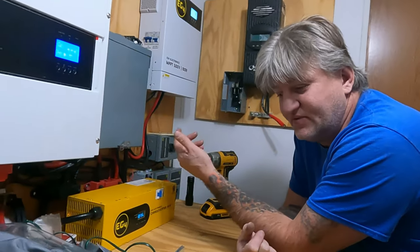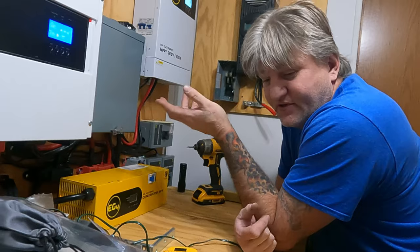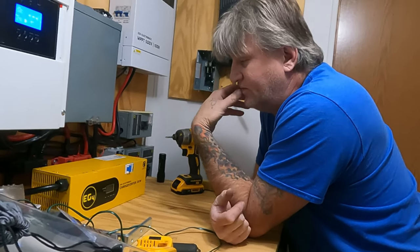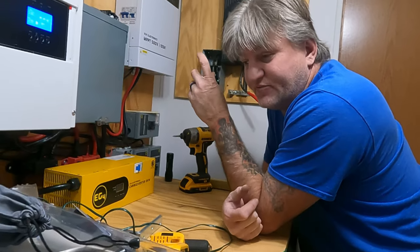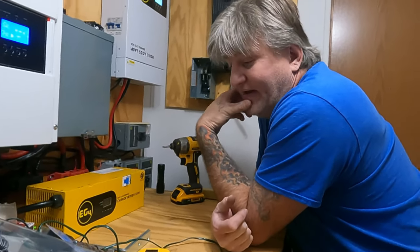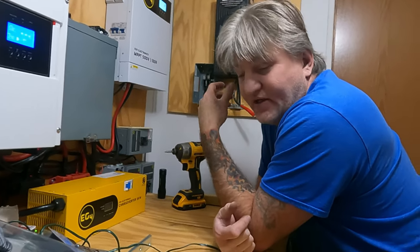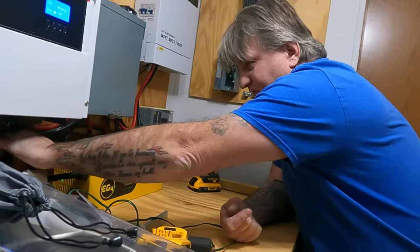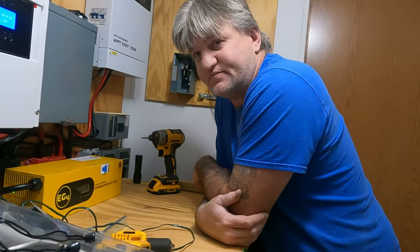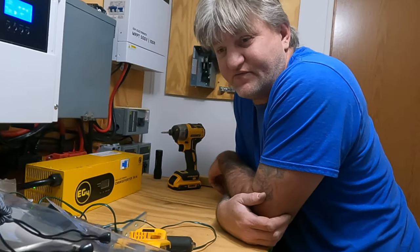We only got that generator because it was the cheapest one we could find. I didn't want to spend a fortune on another generator because we got that big one out there. I just got to clean the carburetor or something in it. It runs perfectly fine when you spray start fluid in it. So I have to get that running again, because that little generator just won't cut it on bad days, because it takes 7-8 amps to run the house with lights and refrigerators and freezers.